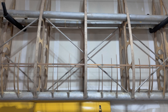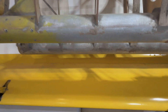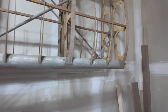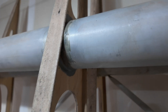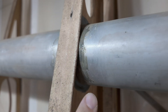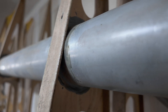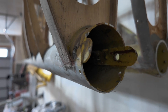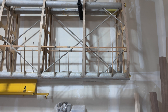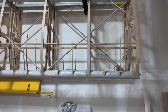The wings obviously came from a previous build — they look like they were probably flying. If you look at some of the details, it looks like there was fabric on this at one point, painted yellow. The wings look a little dirty, which was a little concerning at first, but some sandpaper cleaned up those little spots. Inspecting the bonding areas, it looks like they were prepped — you can see the sanding marks, and it looks like there's a nice bond. Overall they're in decent shape, they just need cleaning up. These are your traditional Speedwings with 18-inch rib centers and 065 wall thickness. I realized the fuel tank would normally be in the first two bays without that rib, so this was probably an early build without wing tanks.